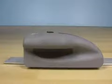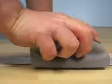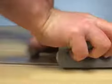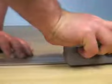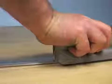The overlapping layers will be cut in one step alongside a metal bar. A sharp round blade and an infinitely adjusting device have been specially developed for the Provenol knife to achieve an exact depth of cut. The overlapping floor layers are cut in one step by leading the knife alongside the metal bar.